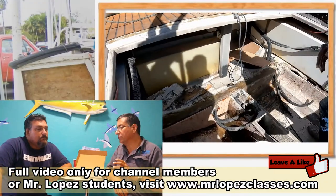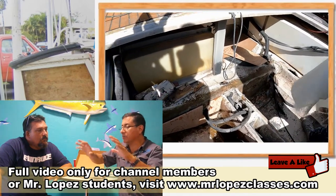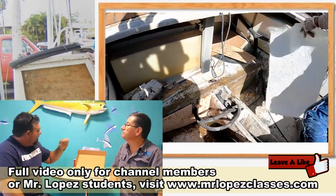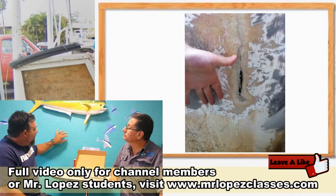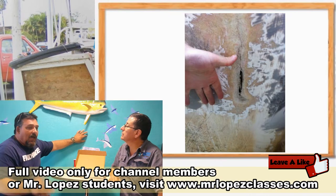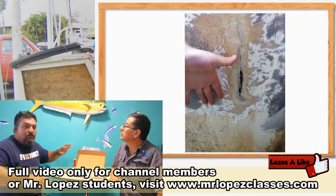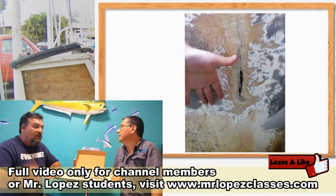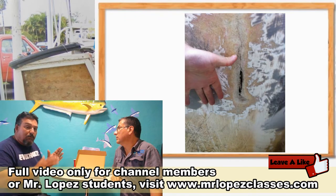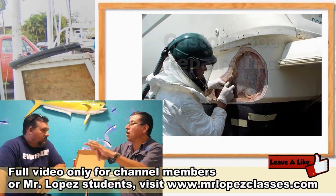We are going to refresh for our students. I want to do a reparation. What is the first step when you try to do a reparation in a fiberglass structure? Let's say there's a gouge on the side of the boat. Basically what I would do is open the gouge a little bit to get more fresh material. And don't use bondo — bondo's not going to cure anything. If you just put bondo over it, as soon as you use that boat, the bondo's going to crack. If you have a hole like this, you go a little bit bigger all the way around so when you put the new material, it bonds to the fresh fiberglass. The first step is to remove the old contaminated material.